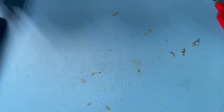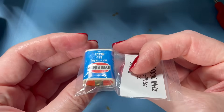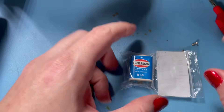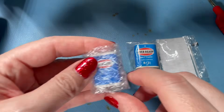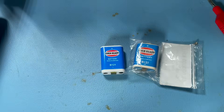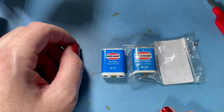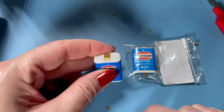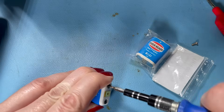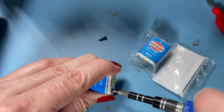Here's an original old Ever Ready B121 — long since no good, but I keep them because they look really cool. I love the old Ever Ready batteries. Now here's something even more cool — I found this seller on eBay who sells reproduction ones. He's made it the same size as the original B121 so it's compatible — you can use it in an AVO, which is why I bought it. There are two little screws on the bottom, and if you take those out there are actually replaceable batteries inside. I'll leave the link in the description — I think they do a few different obsolete battery types.